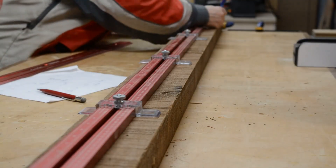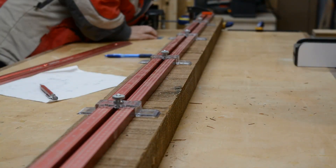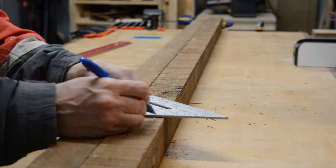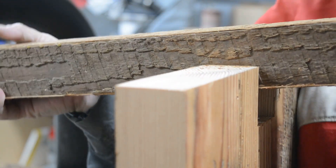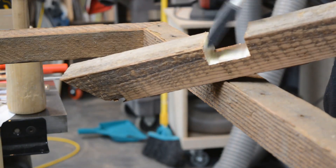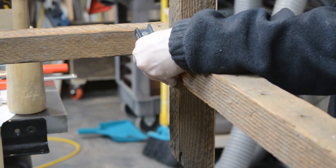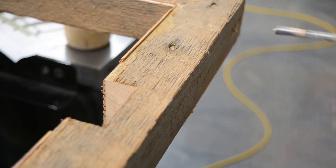I then laid out positions for the notches on the legs. Placing the legs side-by-side ensures that the shelves will set level, which is particularly important as those shelves do fit very snugly. Next, I assembled the first few half-laps and glued up the mitered corners. I should note that these were previously sealed with a 50-50 water-glue mixture to make sure that the joint didn't just soak up the glue when I assembled it. I then secured each mitered joint with a peg.